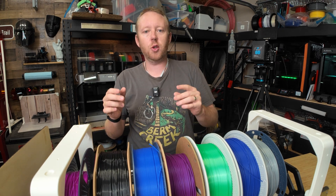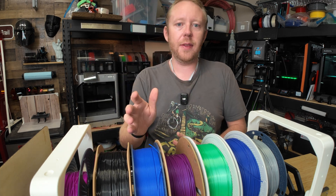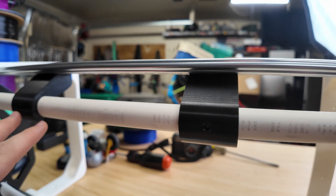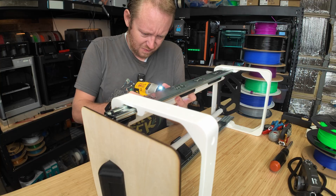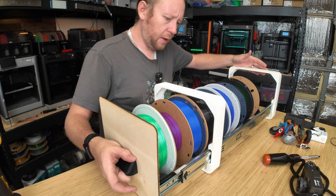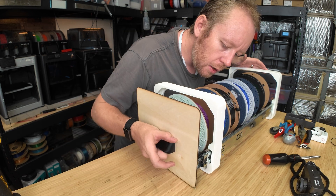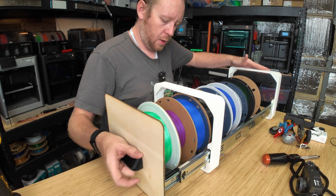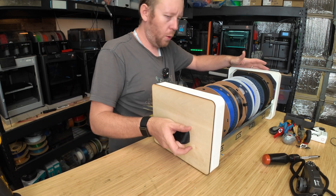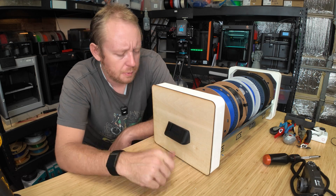We have to drill into the PVC pipes from the supports — that should fix this. Let's unload and retry because I definitely messed up. Hopefully you can see it, but there are screw holes here so you can drill straight into the PVC pipes. Editor Adam here: what I found is that the Sunlu rolls were a bit smaller, so they sat lower in the frame between the two PVC pipes and were actually catching and snagging on the frame itself — so that is something you should know if you plan on using Sunlu rolls.